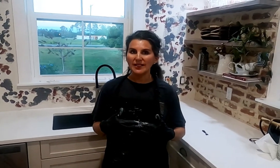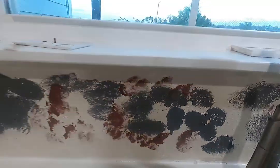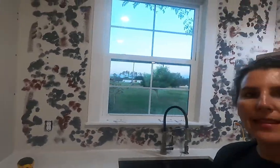I get my brush and start dabbing away. I don't need as much as the gray — it's not going to be such a pronounced undertone, just highlights. I've now finished letting this wall dry with the two undercoats. It's taken a little over three hours — I think because you apply this mixture so thickly it needs dry time. Something I learned: on a vertical wall the salt wash mixture will start to drip and sag and not stay in peak form. That has to do with the consistency.